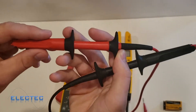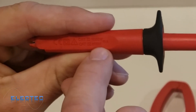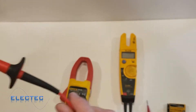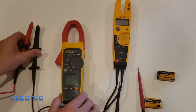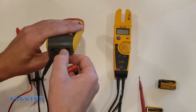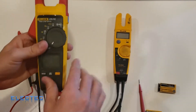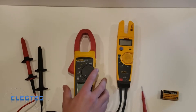If I was measuring anything outdoors it would be category 4, 600 volts — and I'm not going to hit anywhere close to 600 volts, so these leads are good. Also, this lead is rated up to 10 amps, which is pretty standard. But on these meters we're not doing amperage checks with the leads, because as I pointed out, these leads can only do voltage and ohms — there's no 'A' symbol on there.